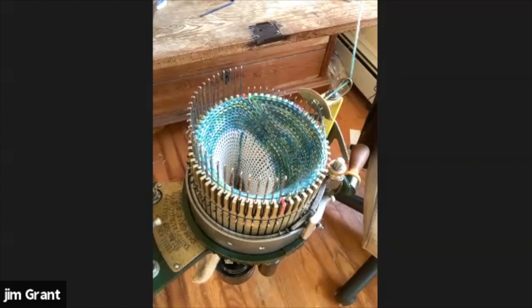Okay. Is the yarn carrier right in the way of it? Yarn carrier is past it. Okay. Can you lift the needle up? I can't do anything with it. Why not? Is it jammed? Yeah. Can you go by with your yarn carrier at all? No, it just hits. It makes a noise and stops at the counter. I can't go forward or back. So that needle is jammed.